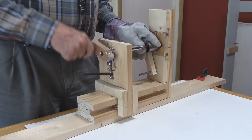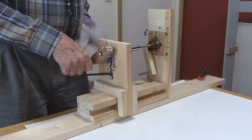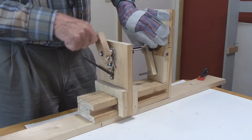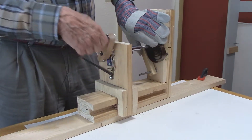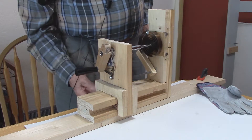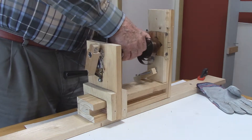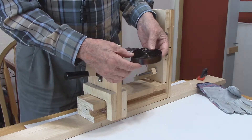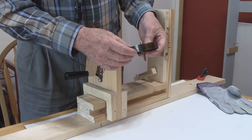Winding the mainspring up so we can remove the sleeve. We remove the sleeve and now we unwind the mainspring, guiding it with our gloved hand. There — the mainspring is out of the sleeve and out of the barrel, ready to be inspected, cleaned, and lubricated.